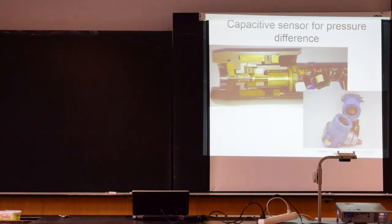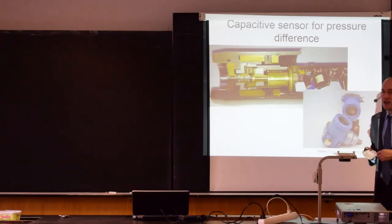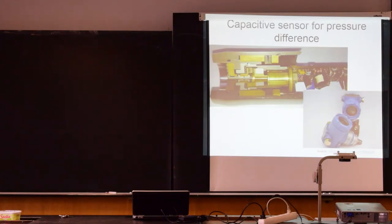This whole system is then typically mounted in pressure sensors. Then they look like this. So this is the sensitive part, and the electronic circuit is here, eventually with a display that shows you locally the pressure, and then it transmits the data to the control system. The diaphragm here in this picture is made from stainless steel, but it doesn't have to be from stainless steel. It depends on the environment where you measure the pressure. It can also be made from ceramics, for example. So here I have some examples of the diaphragms. This is a ceramic diaphragm, and here on the back of it there are the strain gauges installed, and through this connector it then goes to the electronic circuit.